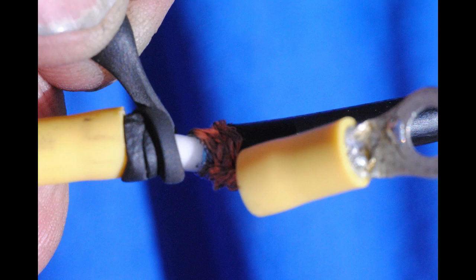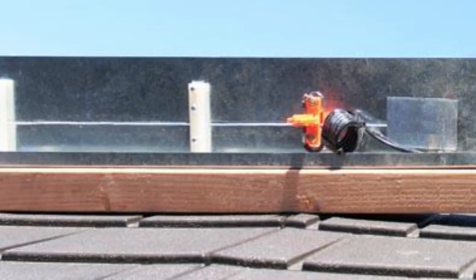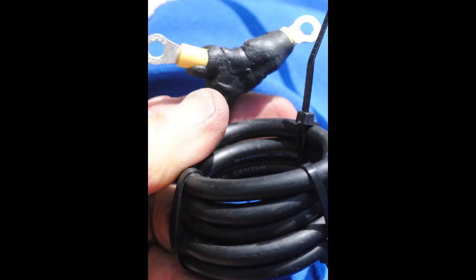That's really cool. I was amazed at the SWR value of it. Now, that one, we'll hold that for a second. That's one on your roof. That's just a flat plane, correct? Yeah, that's making a slot on a simple piece of galvanized steel. The fixture that's driving it is magnetic, so it can be moved. That was during the testing procedure. Normally, that would be replaced by screws. And it's tuned by that piece of aluminum tape at the end to change the length of the slot. A slot changes frequency just like a dipole by changing its length. Isn't that something? That's really something.